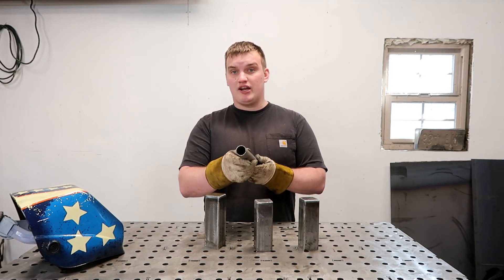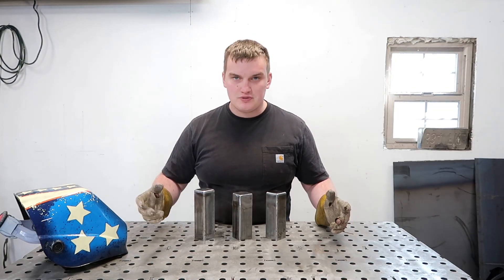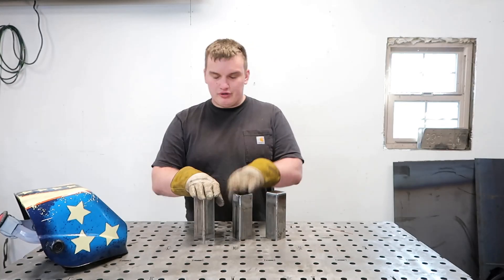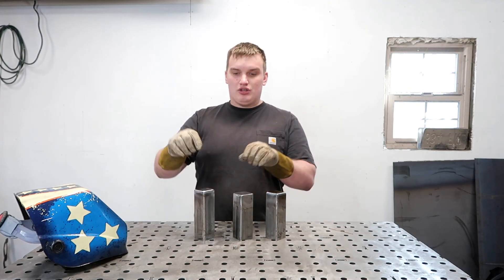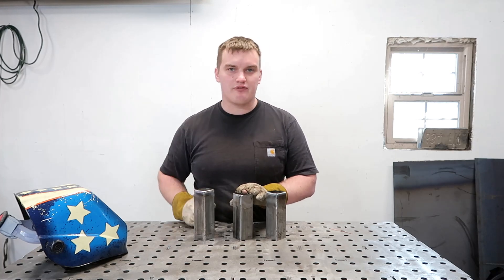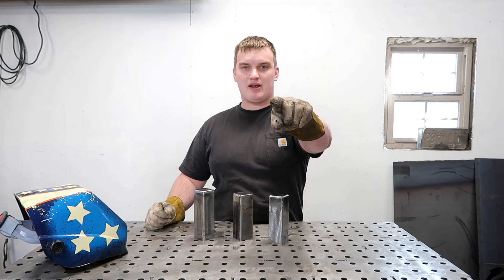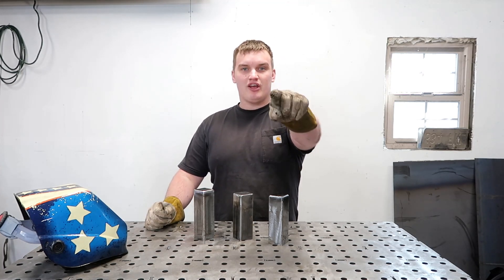These methods are not confined solely to square tubing — you can use the same principles on any sort of round tubing as well. Thanks for tuning in guys, hopefully this was helpful. Make sure that if you use your top cap or inside cap method, you bevel your cap so you get a nice good penetration weld, especially if you're going to be grinding that weld off and finishing it. Subscribe so you don't miss next week's fabrication tip and tutorial, and go build something!